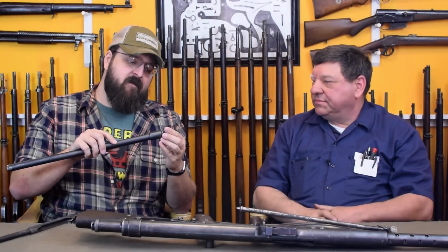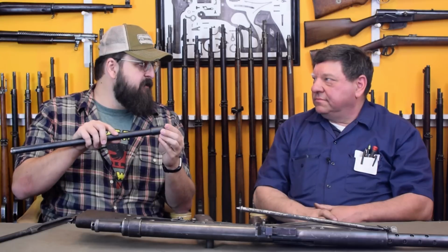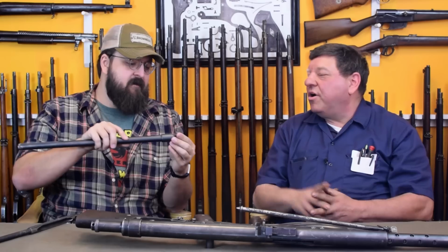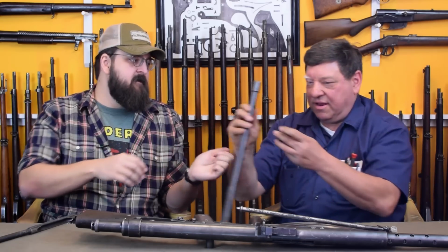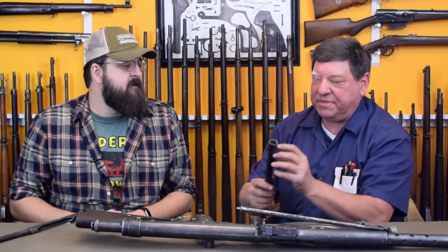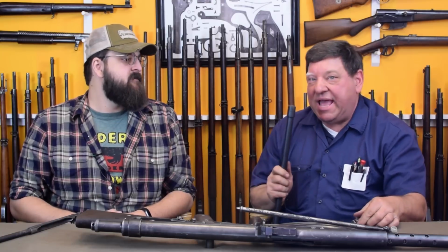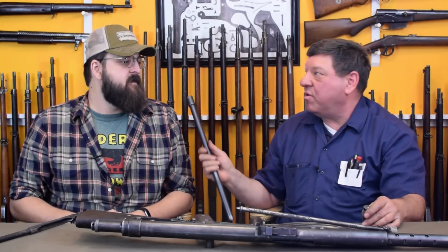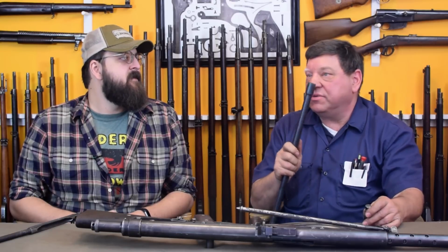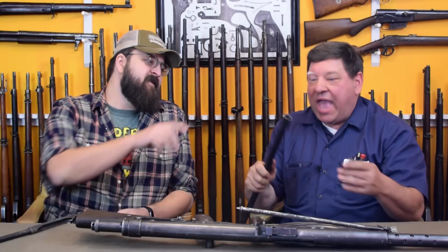So what happened is the Lewis gun was actually functioning only because the carbon buildup was holding up enough gas, because these parts were no longer connected. Not only that, there was an enormous amount of gas erosion up inside here because the piston only sits up about here. But what we did that hadn't been done in the 70 years prior was we cleaned it. Yes. And that's what happened, because the gun was unclean from when it was last shot. The threading was made of the carbon.